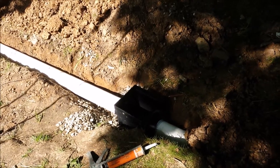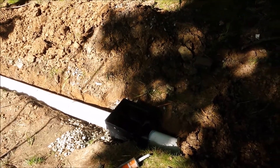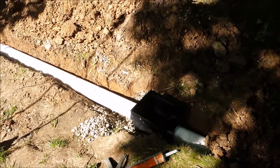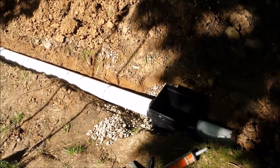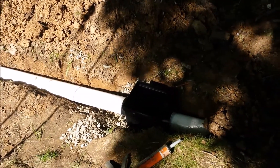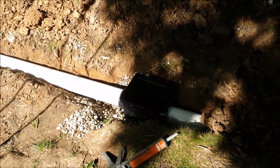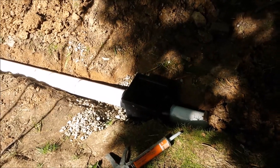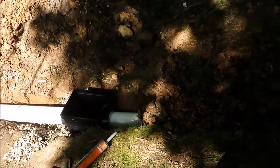I started this just over a week ago. All that's left is to start backfilling — I've got really clay soil so it's going to take some crushing and smashing. One other thing: when you put the basin down, stomp it into the ground a little bit to get it settled. I've had some rain so it settled in. Push it down to make sure it seats really well, because worst case it sinks an inch and you have to dig it up and set it back level. Repack the rocks and get it to sit really good.